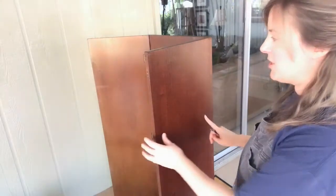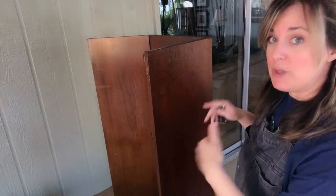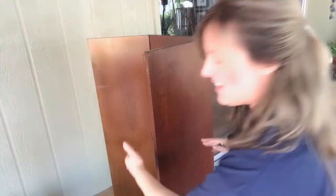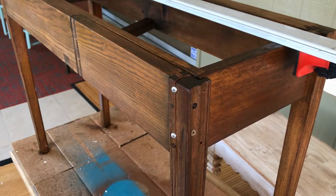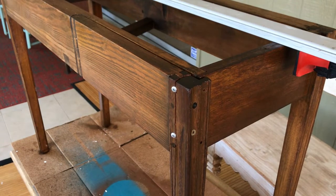Of all the wood pieces I've ever done, normally when I do the oil, you come back the next day and start to see it needs a little bit more in this area or that. This one — by the time I had flipped it around to do the other side, I could see it needed it again. This thing was thirsty. The top piece could definitely use some sanding, but seeing as I just put this very dry, brittle, old piece of furniture through a saturation of oil, I'm not going to mess with it. It's a little too tender right now, so I'm going to let it soak up the oil and start working on the base. I've cleaned and oiled this piece of furniture because I want it to be its most flexible when I try to repair it.